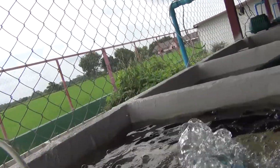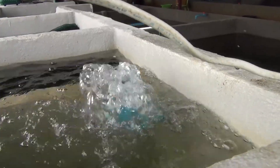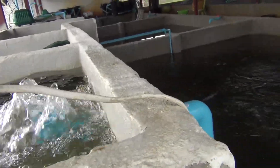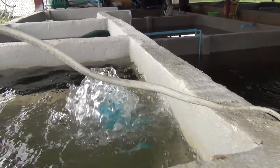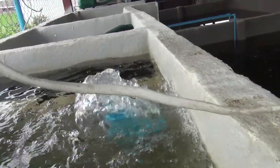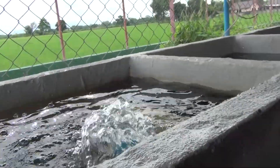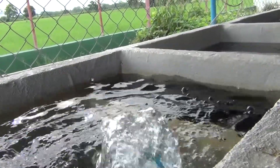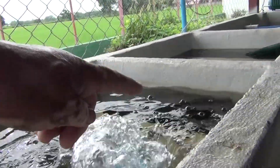The one change that I did was this: I added a 90-degree elbow here. Before, I had a pipe going all the way down to the bottom, and every time you shut the pump off, it would siphon the water back into the tank. When you turn the pump back on you have to refill it — which is okay since it's the same water. The reason I put this elbow here is because it brings the water up and aerates it, and helps separate some of the rust and settle it to the bottom or catch it in the net.